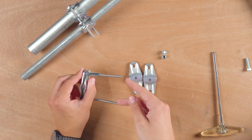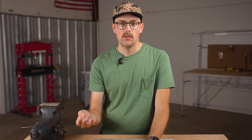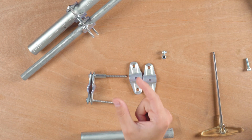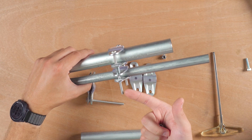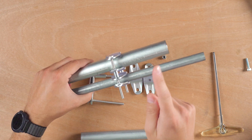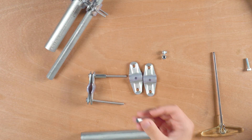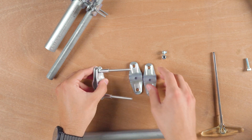You want to make sure to get hardware based on the pipes you're connecting. If you're doing two half-inch EMT pipes parallel, you don't want a 90 millimeter bolt because you're going to have too much thread sticking out. I think it looks cleaner with a shorter bolt — even this one is kind of too long for this half-inch and one-inch EMT parallel. Basically, you can customize the spacer and bolt length based on the tubes you're connecting and the gap you want.